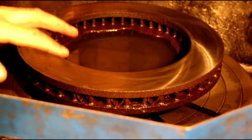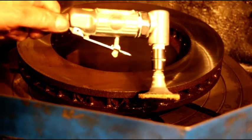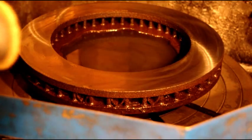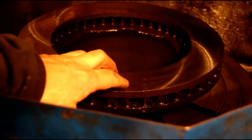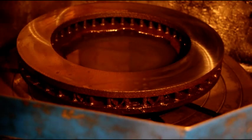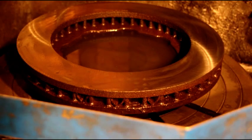Now, rotors are supposed to have a non-directional finish. You can take a little grinder like this — it's got a scotch-brite, a brown scotch-brite pad on it. Like this is perfectly good; I've done rotors like this before and they're super smooth and stop perfect. But I figured I'd show you the non-directional finish in case you want to do that. It's entirely up to you — either way works fine. I'm just going to turn the table on and show you what I mean.